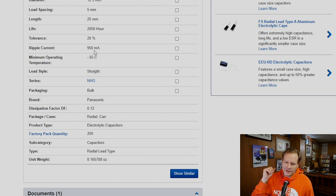What's happening here is this ripple current rating is actually a longevity or life expectancy performance rating for the capacitor. It means that you can have a ripple current going through whatever the voltage rail is on your circuit, and your ripple current can get up to 950 milliamps — and this capacitor can handle that and stay within its heat range and tolerance performance range before it starts to break down. But if you get any higher than that, you're going to start wearing out the capacitor a whole lot quicker.